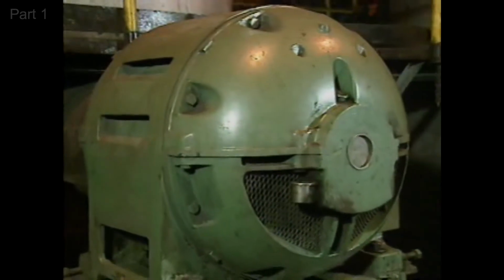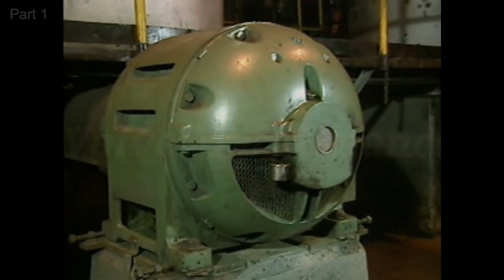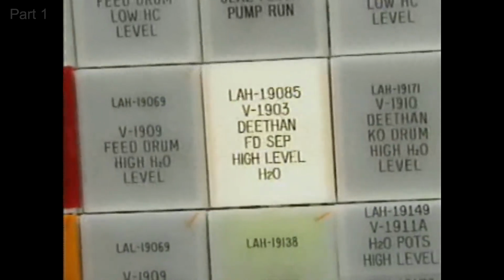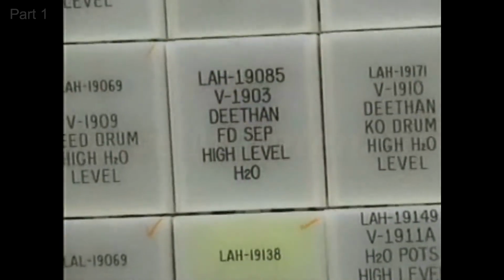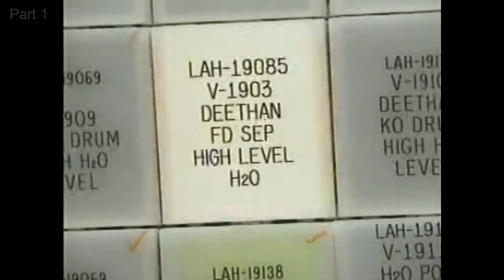Additional components commonly found in AC motor controllers are pilot devices. Pilot devices are electromechanical devices that can be used with motor controllers for a variety of functions. For example, a pilot device can be used to sound an alarm or to protect a motor that a controller operates. A pilot device is activated by specific changes in the system in which it's placed. When it's activated, it usually either completes or breaks the circuit from the power supply through the M coil of the controller's contactor.